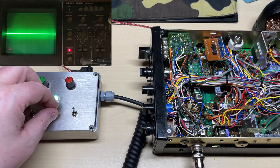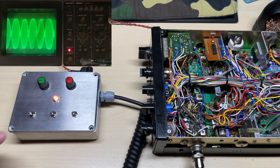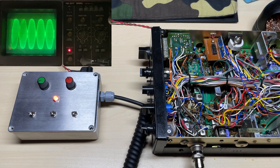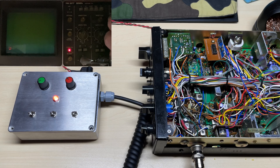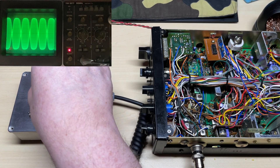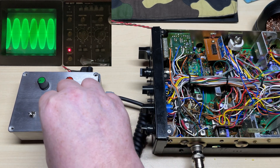Let's try it on a radio — here's my trusty multi-mode 2. I'll put it on to transmit, switch both the tones on, and with a little bit of fiddling about with the scope's trigger we get a nice steady — well, steady-ish — waveform. We can adjust the amplitude of that and adjust the two-tone balance, so it seems to be working quite nicely. Happy with that.